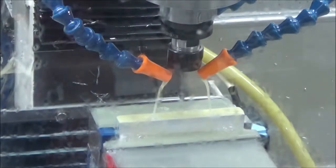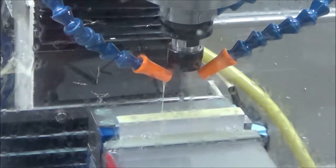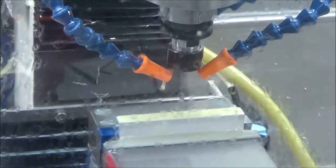Hey, you have to be very careful using those magnets as vice stops. When you use them, you have to pay attention, make sure they don't move between your shifts, and everything's fine. They're pretty strong magnets, but they will move. So you have to make sure you're solid when you get ready to make your switch. It's not as good as a vice stop, but it'll work.